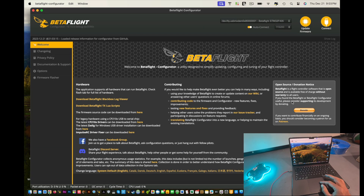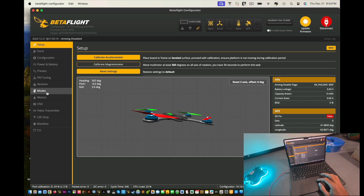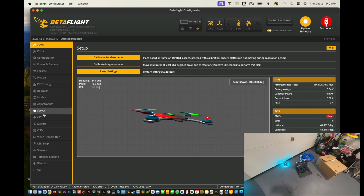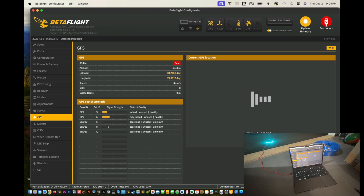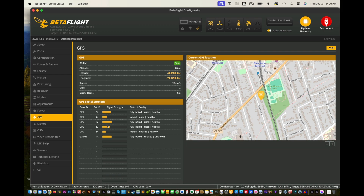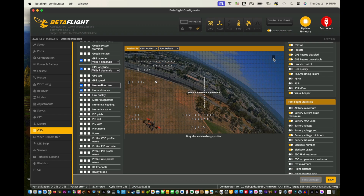To see that it works — remember we took off the LiDAR sensor — you launch Betaflight and then you go into expert mode and then the new menu appears. With the new menu, you'll see it says GPS. What you want to do is plug it in and let it get the satellite connection before putting the battery in, and before connecting to the goggles. As you can see, the GPS is working — we've got our location — but now we want to connect it to the goggles so that we can see everything in the OSD.